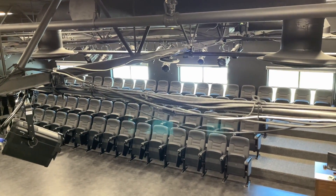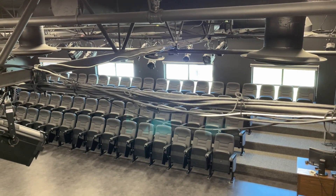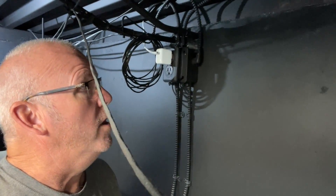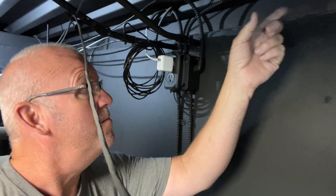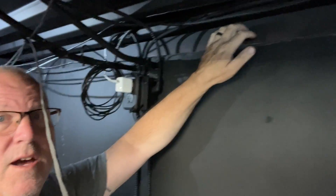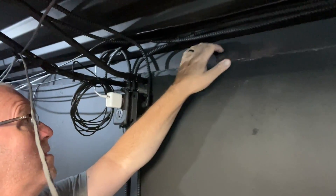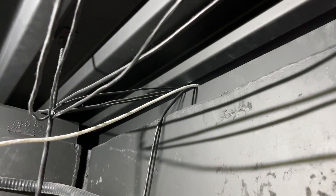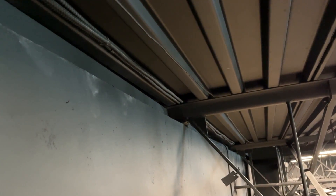I'm back in the drama room — here's a bird's eye view. I'm on the other side of the wall from where I was installing that drywall fire break. This is a steel beam that all the roof trusses connect to. From a fire protection standpoint, we are now good with 5/8" drywall completely sealing everything up. Now this is just an effort to minimize as much sound transfer as well.